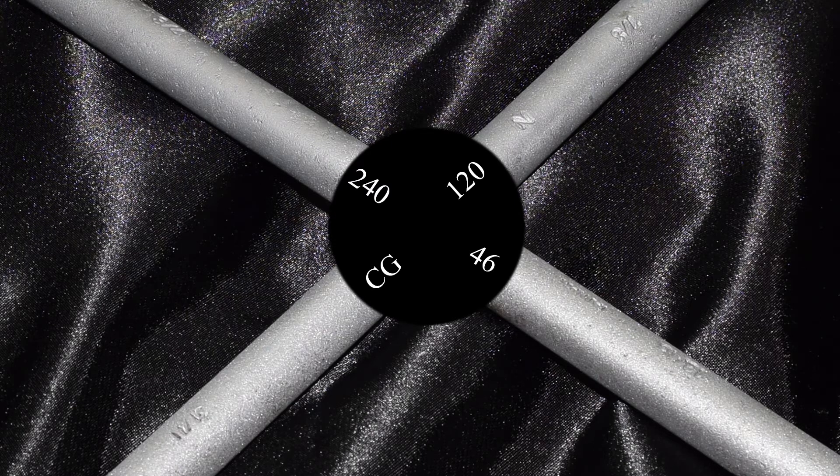It's a softer material, so it will break down quicker, but it still does a good job. It also comes in a range of sizes. There are different grades of the aluminium oxide as well — there's white, pink, brown. They have varying degrees of iron content and other impurities in them. It's probably best to get in touch with us here at Dana Ridge and we can discuss the best media for your application.